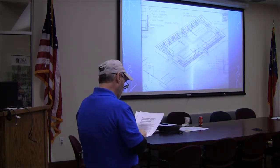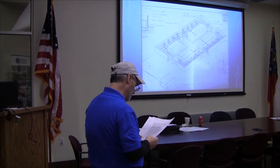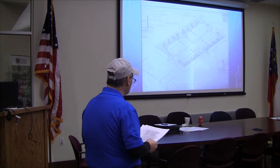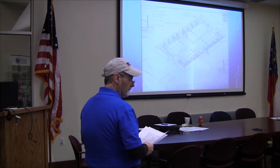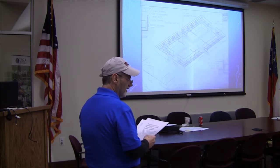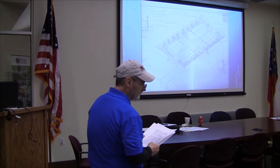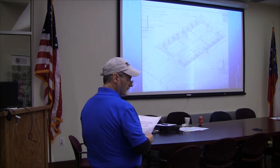So in a nutshell, a new home has footings with at least 20 foot of half-inch rebar embedded in those footings, which need to be used as primary grounding electrodes. This new provision in the National Electric Code requires a lot of coordination between trade projects and manager. That kind of gives an idea of what I was explaining at field day about grounding and using the ground as a ground plane to reflect your antenna signal.